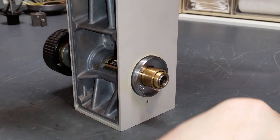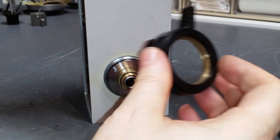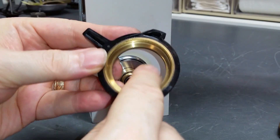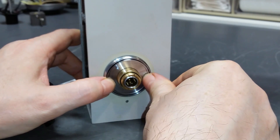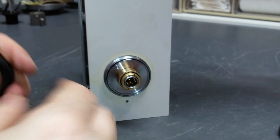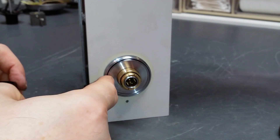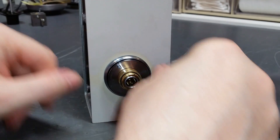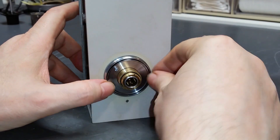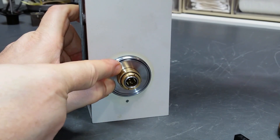To get an idea of how this thing works, we put this disc inside here. Ordinarily, the collar would be screwed on there, and when the collar is screwed on, this brass surface pushes down on the top edge surface of this disc and holds it stationary. So when the knob is loosened up and not pressing down, this disc is easily free to move without any real friction. On the other hand, if the knob is tightened down, it effectively presses down on this disc, and then the disc would be locked in place and the pin would be stationary.